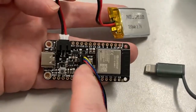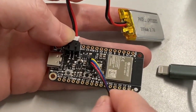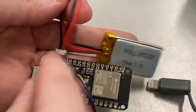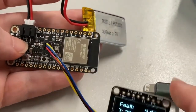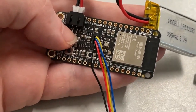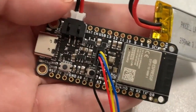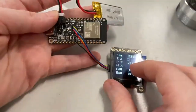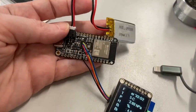This is plugged into the new Feather ESP32-S2 with PS RAM, and I'm just testing out the I2C connection. It's got a STEMMA QT connector that's vertical, popping right off the top. Battery powered with Wi-Fi and ESP32-S2, so it's Arduino and CircuitPython. This version also has a little sensor, the BME280 — one of my favorite temperature, humidity, barometric pressure sensors — on the board. It's a variant of this Feather; not all Feathers will come with it. You can see it's displaying temperature, pressure, humidity, and the battery voltage and percentage. Nice demo.